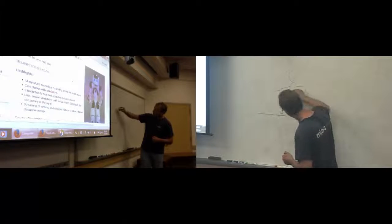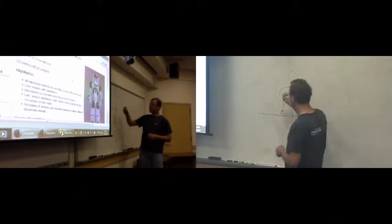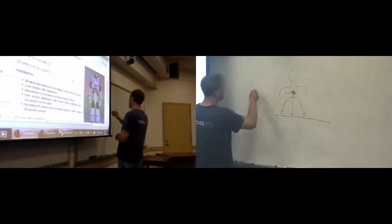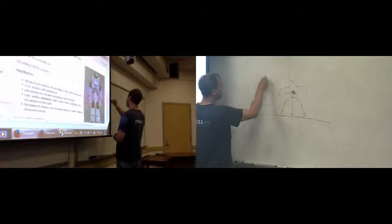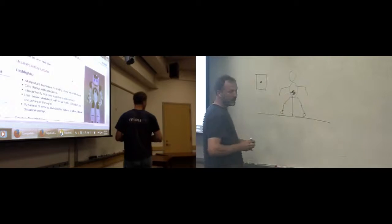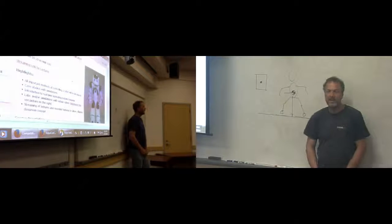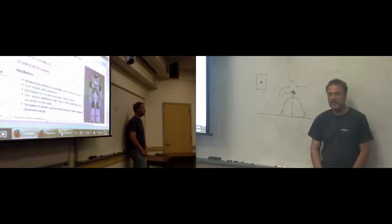What you need to do is get the center of mass over what is called the support polygon of one foot. So make one foot of the NAO roughly look like this. And so you want ideally the center of mass to be smack in the middle. So we have essentially a center of mass planning and execution problem to make this work.